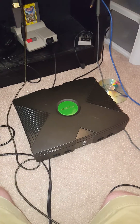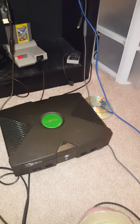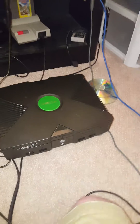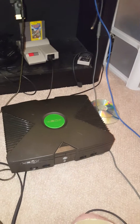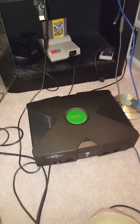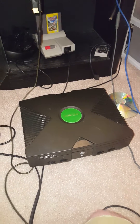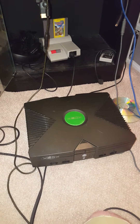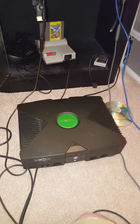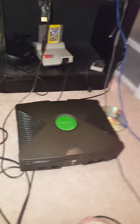I had the goal of modding an Xbox to have an LCD screen in the controller, but that was never possible before because they always had the cold cathode backlight — even the smallest would draw over an amp. Nowadays you can bypass the 12-volt regulator and since they're LED backlit, they draw 300 milliamps.